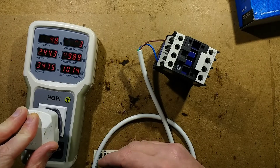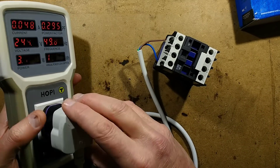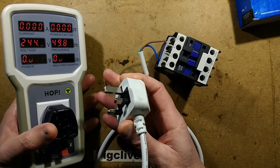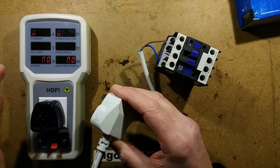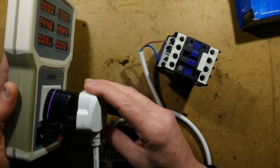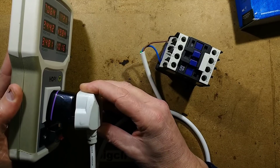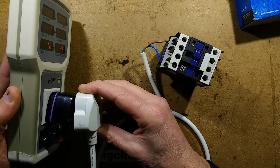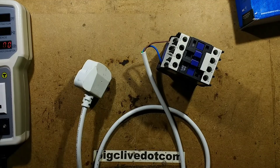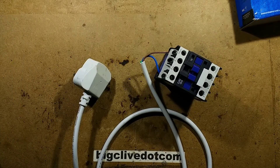The power factor is about 0.293 because this is a purely inductive load. Interestingly, with badly designed control systems, jiggling contactors on and off can actually crash the control computer. There was a company in the refrigeration industry notorious for this — the control system would bring the contactor in, then it would crash and reset, trying to bring it back in again, displaying absolute gobbledygook on its display. I've had this running for a while and it didn't get excessively warm, which is pretty good.